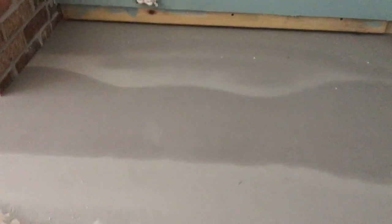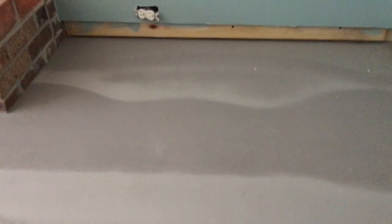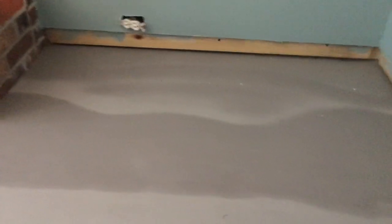Just giving a final update on my use of the Mapei Plus self-leveling floor resurfacer. I used it with wonderful results — poured a couple of bags out here, 50-pound bags at about $29 each at Lowe's. You can see the coloration of each pour: there's a separate pour there, probably a different pour here, and then a third pour here in the middle, all the way down the line, just to build up a little bit.